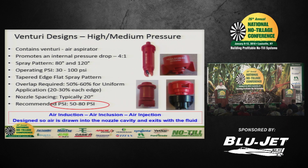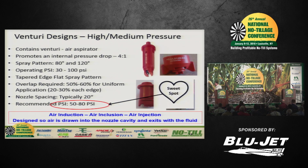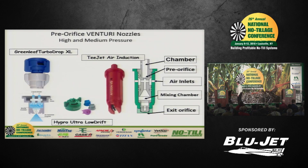And you'll see there it says 30 on the low end. I've disputed that for some time. Overlap requirements similar. And I have the sweet spot circled there at 50 to 80. So over my career, I've gone from the low pressure concept with an XR, turbo T-Jet flat fan, now to talking to people about using 50, 60, 70, and 80 PSI for their spray jobs with this tip. Okay, let's look at a little more detail.